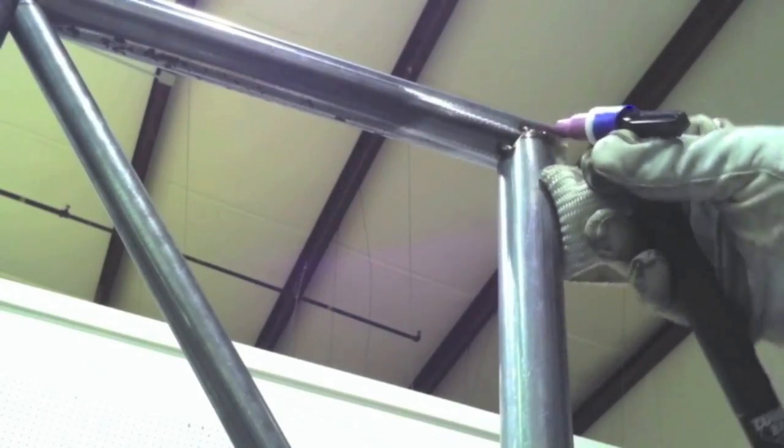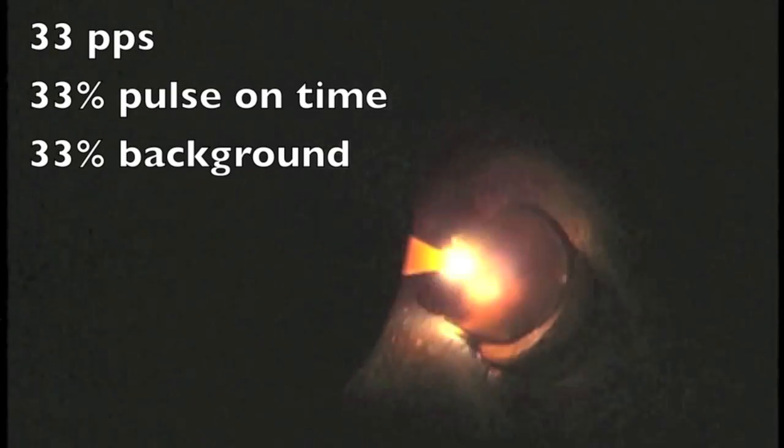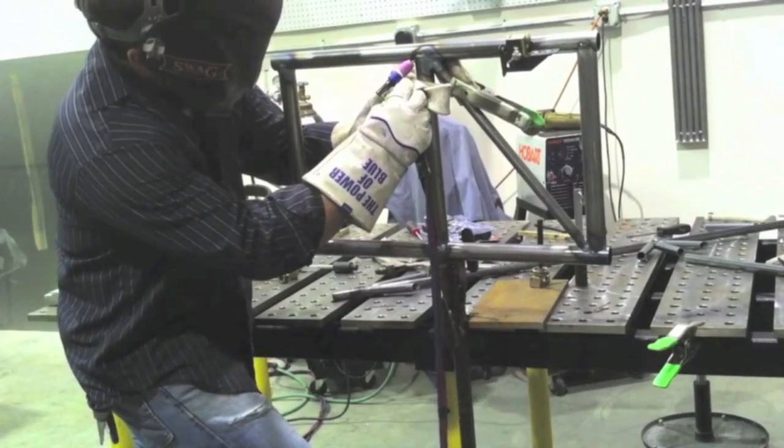It's a very instructive DVD set. There's so much work — a year's worth — it's hard to give just a shot or two in this little trailer. I can't help but put my instructor hat on from time to time. There's also more TIG welding chromoly cluster joints, tips for filling gaps, tips for using pulse — high-speed pulse like the rule of 33 — and how well that works for TIG welding chromoly tubing when there's a slight gap. Tips for hand positioning, tips for argon backing, and tips for using aluminum foil to get better shielding gas coverage on a cluster joint.